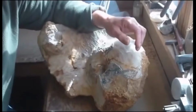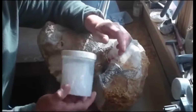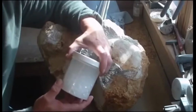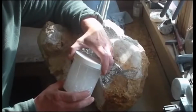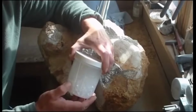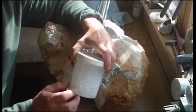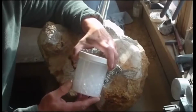To buy Paraloid B72, it normally comes in a crystalline form, like so. You then mix this with acetone to the desired effect that you want. The more of the crystals you mix into the acetone, the deeper gloss the finish will be. It's basically a plastic, and the acetone dissolves it, so what you're doing is putting a plastic coating on whatever you coat.